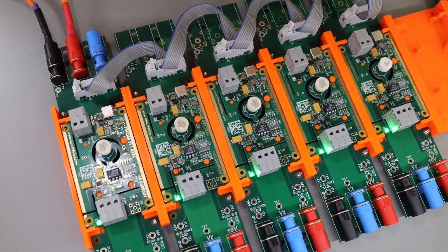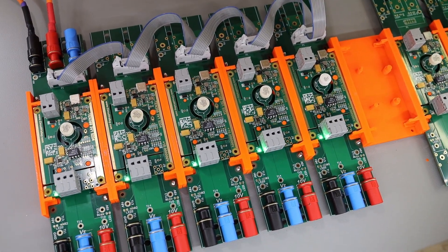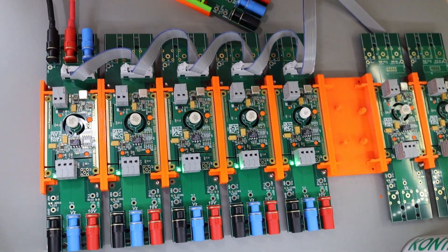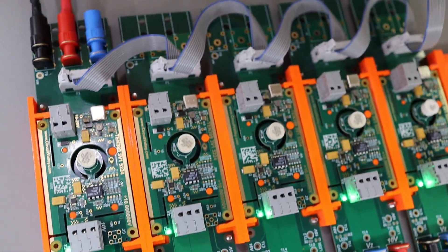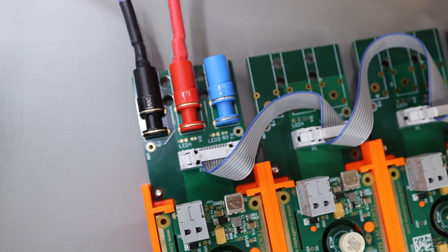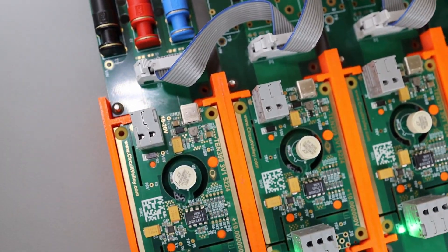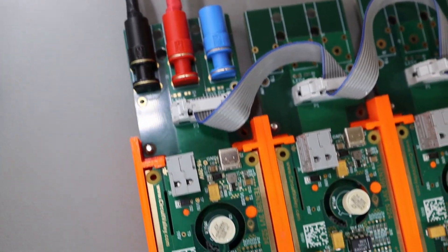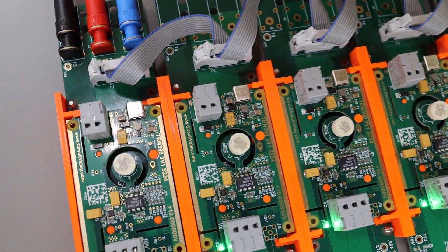This is how the 3D printed contraption looks like. I have printed boards multiple times individually. You can see I have an array of around 8 pieces, and they are all powered from a single power input which is connected to my bench power supply. You can power this board with two power supplies to test both the USB and the primary power input. Primary power input is 16 to 20 volts and the secondary power input is USB. Right now it's feeding the primary power input and all of the boards are getting powered from it.